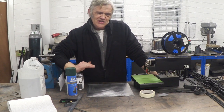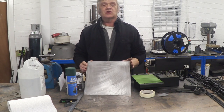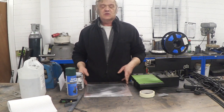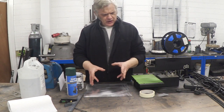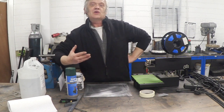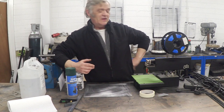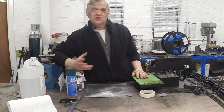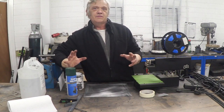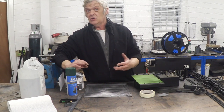The quality of the bed is fixed by the material you choose. If you use five-millimeter aluminium of a high grade that's had the surface milled, you'll get a beautiful bed — but you'd be spending around 200 pounds. For slightly less you can get a nice relatively flat aluminium, like this three-millimeter piece at about eight pounds fifty. Or if you really don't care, you can paint a bit of plastic and stick it on for about 50 pence.